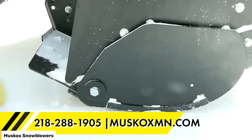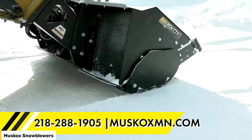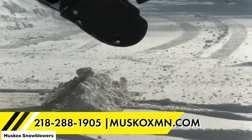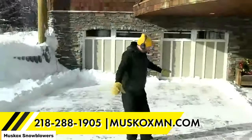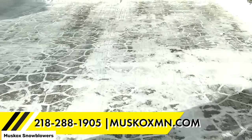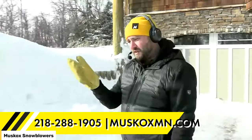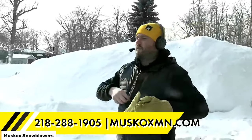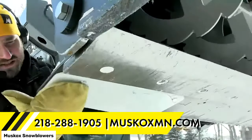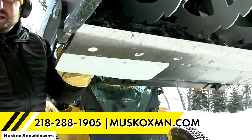If we want to break up or shear any type of ice, we're in that position. Watch Ron go forward — you can see he's pressing more down on that snow than before, and this allows us to scrape any type of ice on the hard surface. We've gone through a couple passes — forward position, back drag and blow — and been able to get close to the garage door reducing shoveling, while also doing a great job scraping this surface. I'm going to get underneath and show you our glide plate and steel cutting edge. The glide plate is about 585 square inches — we double down by riding on the cutting edge. In our forward position, this is what we ride on rather than the tip of one single little steel cutting edge.